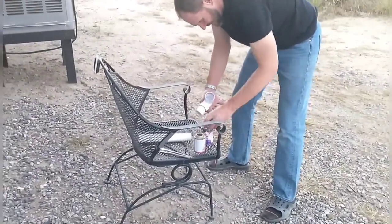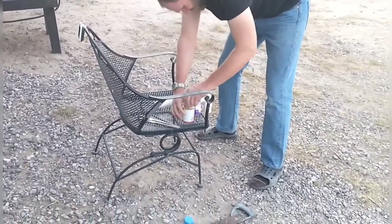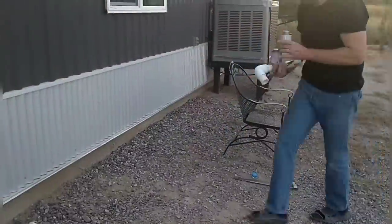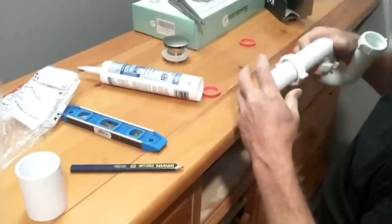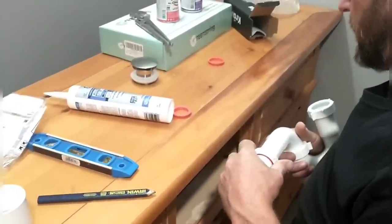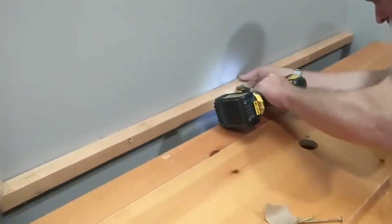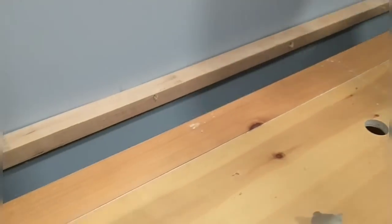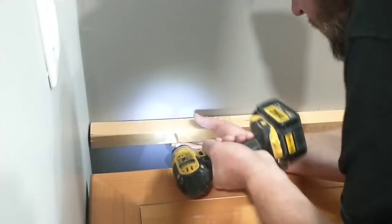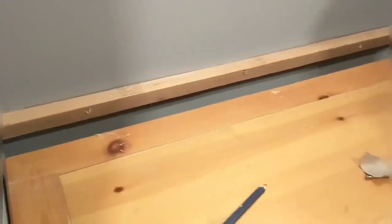I'm doing a little prefab and glue up outside since it has a real strong odor. It really worked out well pulling that dresser out a few inches from the wall and leaving space for the drain to operate behind it — nice not to have to cut up the dresser even more. I brought my supplies in and I'm doing a little fit-up and testing to make sure all of it's going to work well when I go to install the sink. Now I have the dresser positioned and leveled, so I'm ready to install that bird's eye pine board. I need to put in a support board along the back to attach it to, and it will overlap the dresser by about an inch so I'll screw it in and silicone it to seal.